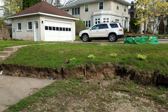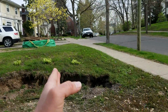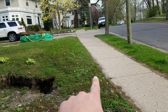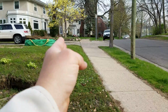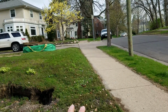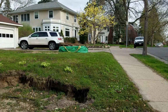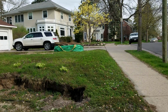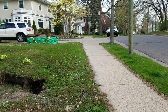it as well. So the wall to the right of the steps is going to come out here, and it's going to stop about 4 feet shy of the sidewalk. And you see how the grade goes downhill here? I don't know if you can catch that or not, but we're stopping it here because that way we can build into the grade, and he's going to put a fence here and maybe some mulch, etc. But that way our return has something to die into, and the top and the back of the wall has something to stop at. Because if we came all the way over here, then we'd have to basically box the whole thing in.